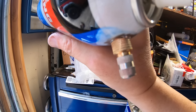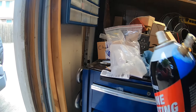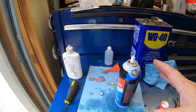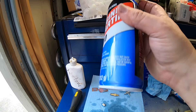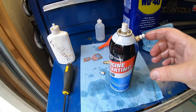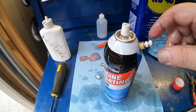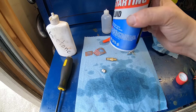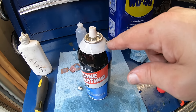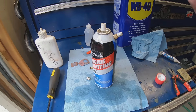A good way to make sure it's not leaking is to tilt it so you've got fluid on the backside of the Schrader — if you see any fluid coming out, you've got a leak. Some people put the Schrader on the bottom, and that's fine, but this Schrader would be a little too long for that. I could machine these shorter if needed. The problem with having it on the bottom is if the valve core's rubber seal ever starts leaking — depending on what's in the can, something harsh could soften that seal and you might come out the next day to a big puddle of carburetor cleaner or whatever. If it's up top and the seal leaks, it's just going to leak air, because what's up top is just air — the fluid is at the bottom. I put mine up top.